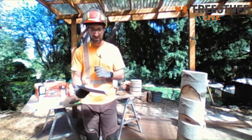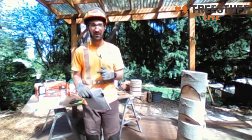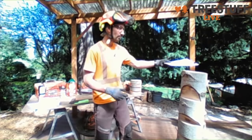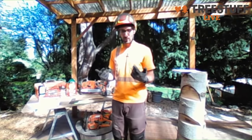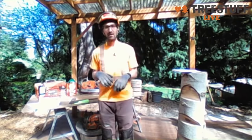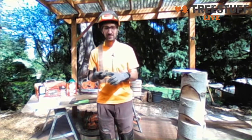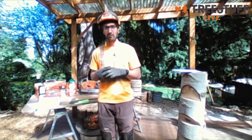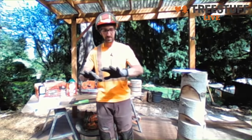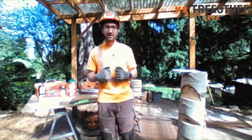All right, so let's get into some safety fundamentals first, and then I want to play you a cool video that we made. So chainsaw PPE. Before doing anything with a chainsaw, I want to be sure that, one, I've got gloves on. Anytime I'm going to be handling that chain, whether it's sharpening, doing maintenance, heck, doing a demo and doing training, I want to be sure that I have protection for my hands. These happen to be cut-resistant gloves, leather gloves, whatever it is. Make sure you have something on your hands.